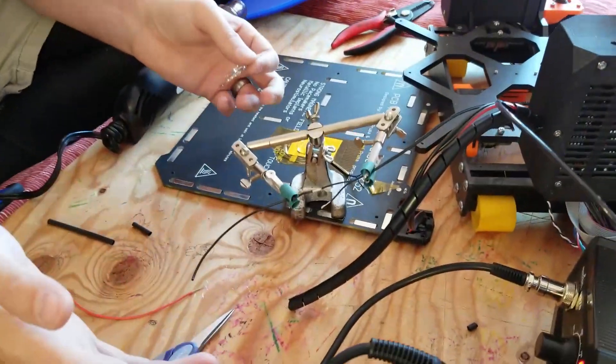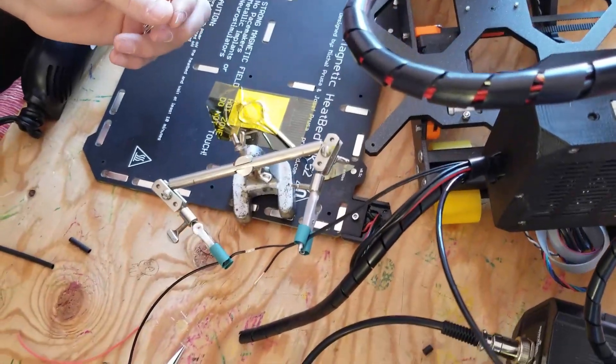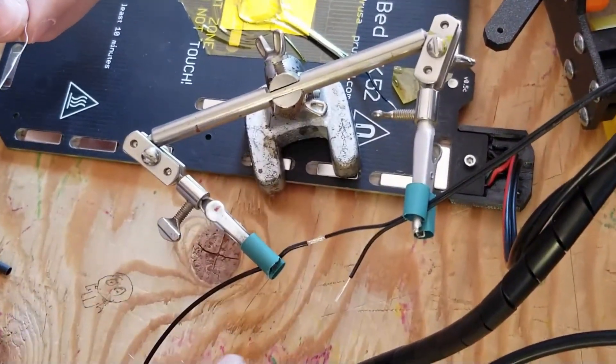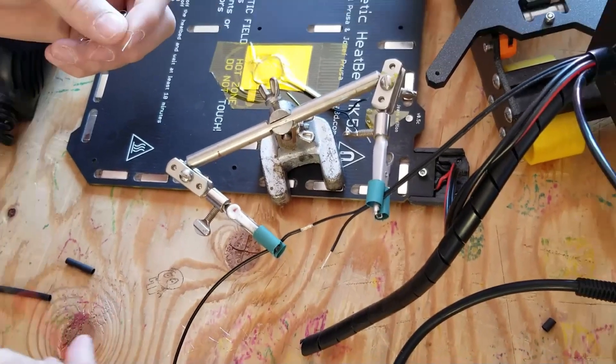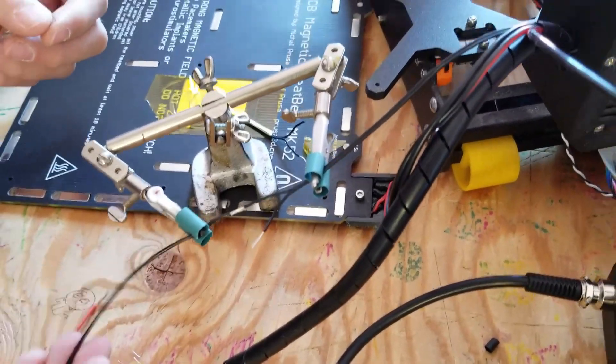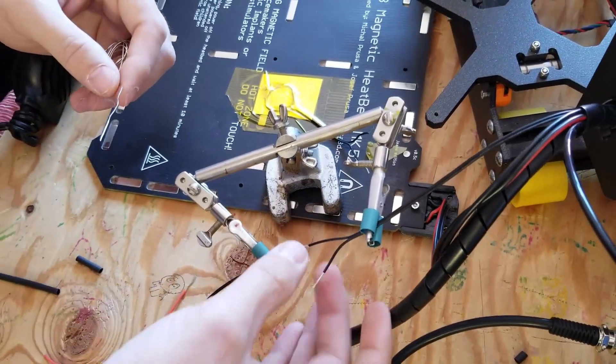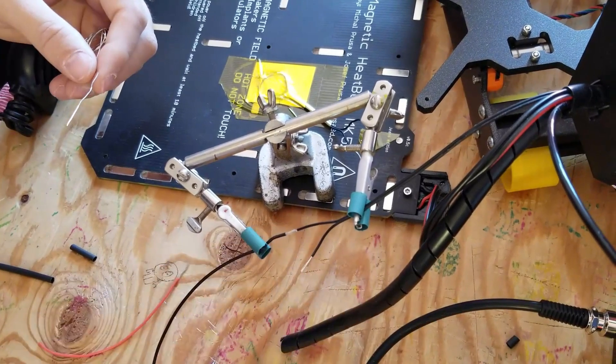This time around I thought I'd show a little bit more of my work — last time I just kind of breezed over it real quick. So what I've done is I cut those back, and now I've got this more flexible wire. I've got a red and a black one, and they're really flexible — that silicone wire — based on that suggestion. I think I'll be good. So I stripped them, put them together here, and now I'm going to solder them up.